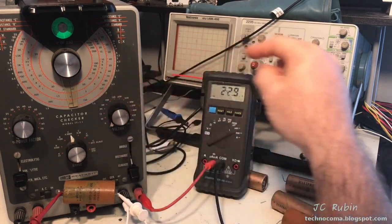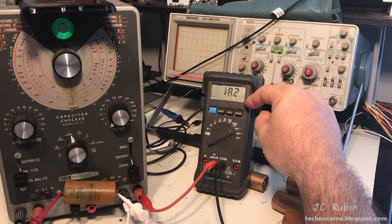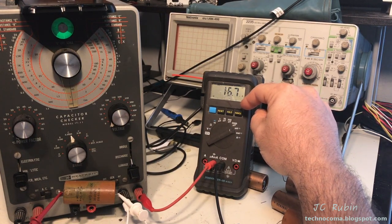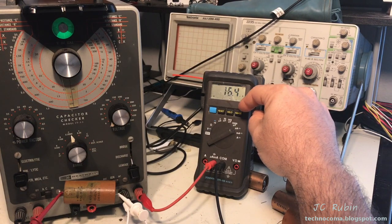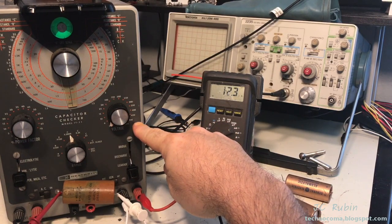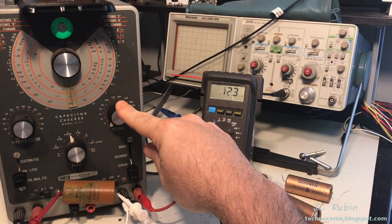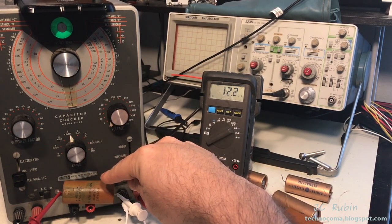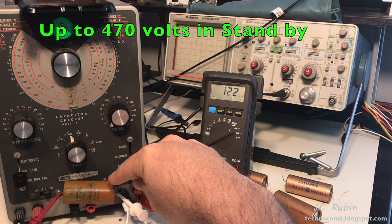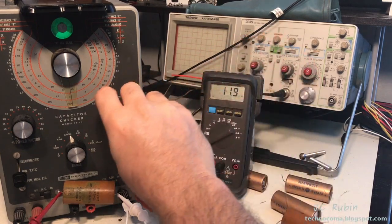we're dead short. It's showing 22, 18 microamps. It's not a lot of current, but it is dead short. So I could imagine that with the eye fully closed at just 3 volts, and mind you, if there's current flowing at 3 volts, if I put a voltmeter up here, we'd be looking at like 1 volt, right? And this is supposed to see the rectified voltage in and around, I would guess like 300 something volts. This would be like a short to ground going through here, and it would just explode, which would be why it would probably blow fuses, right? So I'll bring it up to 6.